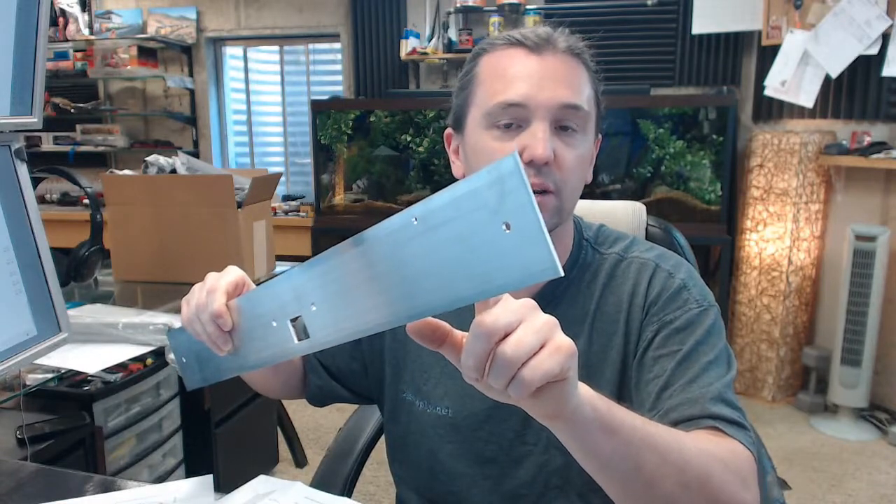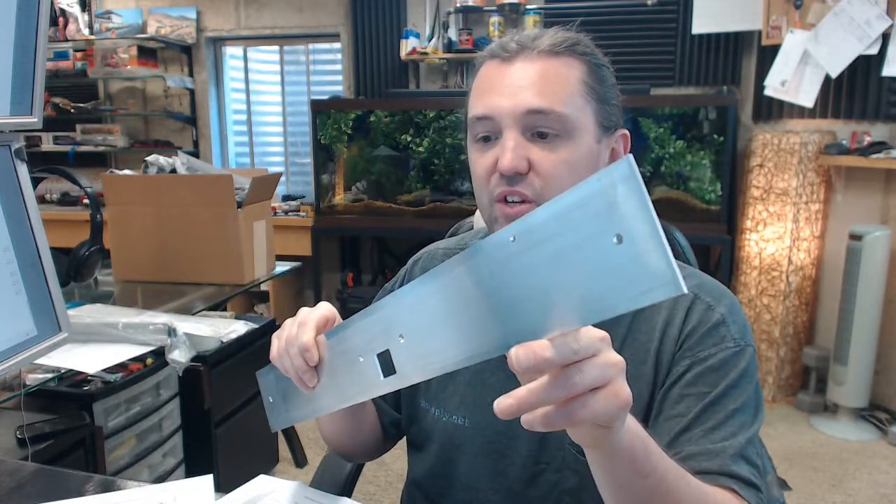The summary: it is a mill finish aluminum, a concealed item — you would never see it. It is a heavy duty theft deterrent system, to be installed with grade 2 deadbolts — meaning a standard, run-of-the-mill, middle-of-the-road, heavy duty residential or light duty commercial deadbolt. Not all residential deadbolts are grade 2; some will be grade 3, but this is tested and rated for use with a grade 2 deadbolt. It certainly strengthens the frame. It is a concealed interior item — your frame casing is going to be over this. It is fairly universal and furnished with a strike plate and screws.